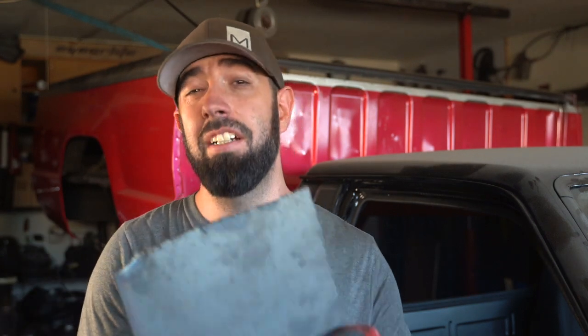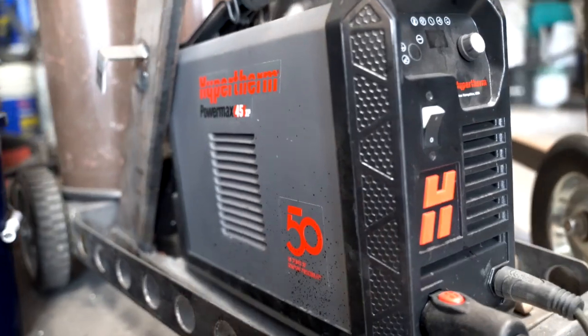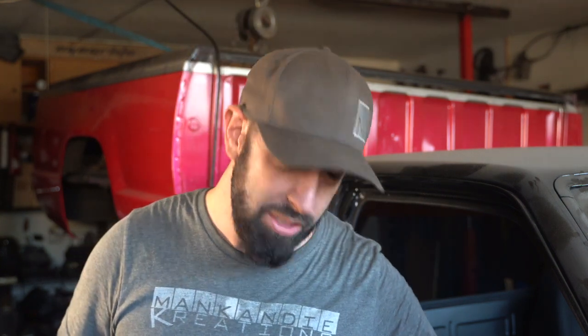I think the best place to start is step one: I'm going to cut the joint plates out of quarter inch steel. But before I do, I'd like to introduce you to my favorite tool. It gets more use here than any other tool because it's by far the most versatile. It saves time, it saves material, it's an energy saver and will likely pay for itself in the first use. What does the most versatile tool in the world cost? More than you can afford, pal. It's cardstock, actually. I get it for a dollar a sheet at the local upholstery store, and I literally use this on almost every project — whether it's fabric, sheet metal, steel plate, and even tubing. If you can't locate any, poster board from any office store would work fine, and you can get it in pink. Subscribe for that one. You'll thank me.